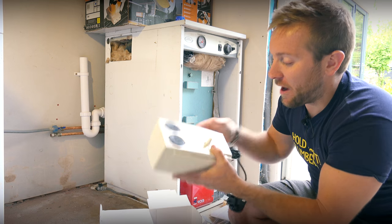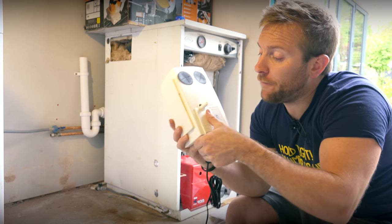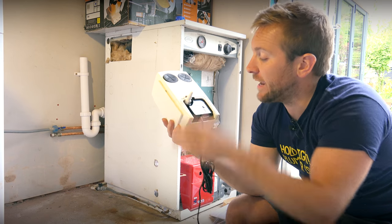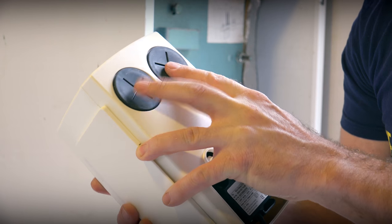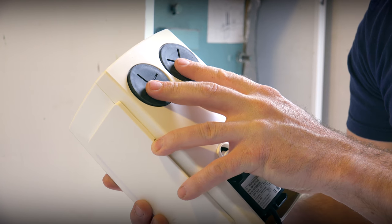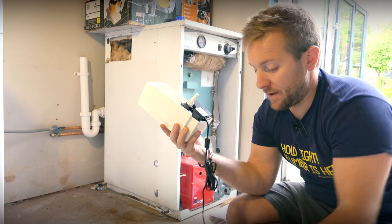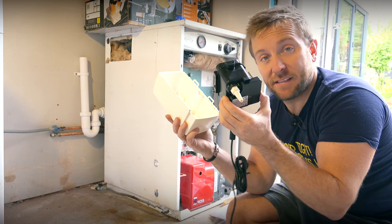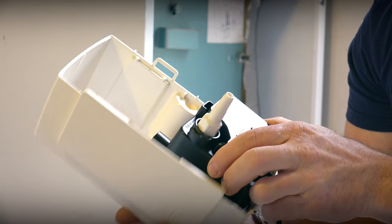And then we've actually got our Plavis itself just sitting here. So a quick look at the Plavis itself. You can take all of this apart really easily. So we've got our two inlets here and here, two rubber inlets that we can remove so we can have two boilers coming into this if we want. We've got our small outlet here. You can pop our box lid off and actually remove the whole pump itself. So if you get any debris in the bottom of the box or anything like that, you can clear that out and give it a wash.